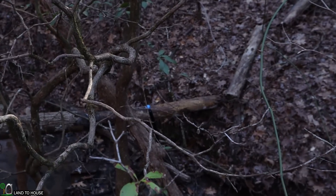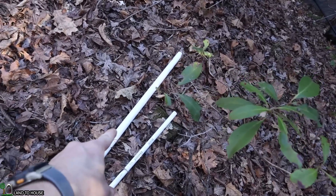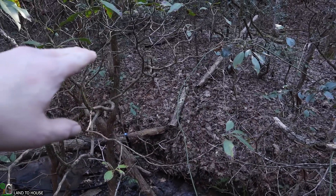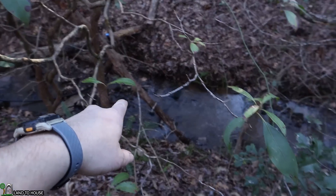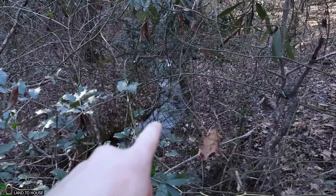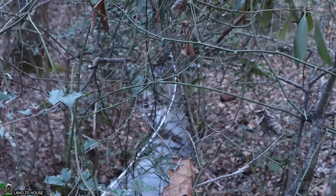300 feet of poly pipe has made it to this point right here. From here we're going to install the stand pipe, which is simply going to be 10 feet of one-inch PVC pipe. That will raise up, and hopefully we'll have less than 10 feet as the water comes down this pipe; otherwise it will flow out the top, which is still okay. From the bottom of the stand pipe, the half-inch PVC drive pipe will carry on approximately 100 feet down the creek. As you can see coming off the bottom of the stand pipe, the half-inch PVC drive pipe is going down the creek — that's being glued up right now.